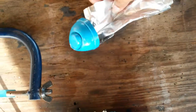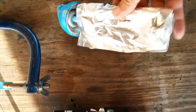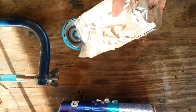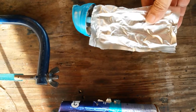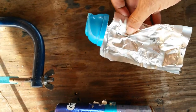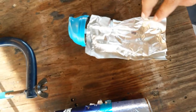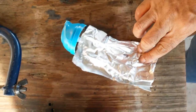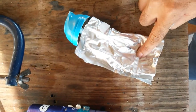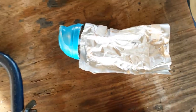It's just a bag. The propellant is not inside here — it's on the outside. Basically, it squeezes this bag and squeezes the mixture through here. I believe the reason they have to go through this design is because the propellant reacts with the substance being propelled, and in that case you need to isolate them.